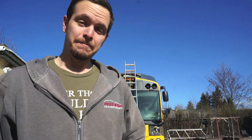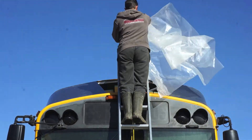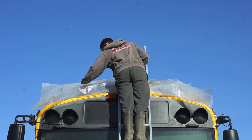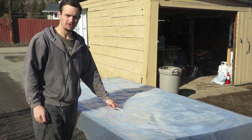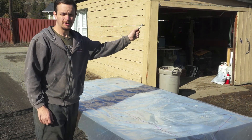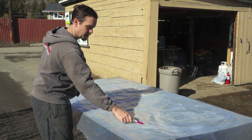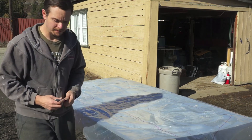It's been a few days since I've worked on the roof raise. We haven't had really nice weather but today it's nice and sunny and not a cloud in the sky — I think you can see that even. So I'm back up on the roof. I've got my last piece of sheet metal and I'm going to go trace it out now. On second thought, the lines that I drew look pretty straight when flat on this piece of sheet metal. So what I'm going to do is go up to the top of the bus and just get some measurements and cut a rectangular piece out. Once I get it on the roof I can scribe the bottom because there's going to be a bit of an arc to it.